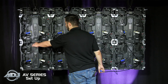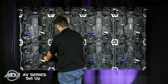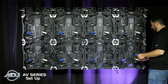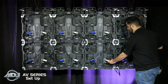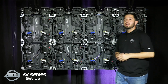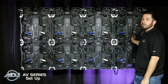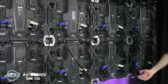There's no tension — they're nice and loose. If needed, you can always hide the cables up in the handles. It's simple — not a lot of cable length left over — and now you have a clear view underneath the panel wall without any cables dangling down. Running vertically also allows you an opening at the top for a redundancy cable, which we also recommend and will get into later on the software side. This is the cleanest possible way you can run your wiring for an LED wall.